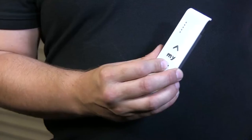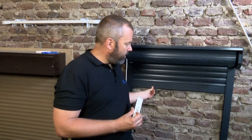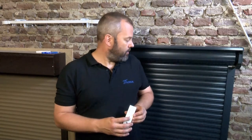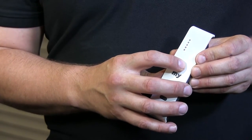I do that by pressing the button and making it roll up, and then I give it a bit of work to do by holding it a little bit, so the motor has to work harder — because in the upward direction normally it works harder. I've done that. So what I can do now is make it roll down — still in the wrong direction, but I make it go all the way down, so you can have one full length of rolling up and then it will recognize the direction. And as you can see now, when I've pressed up, it's going up. So this last part of the procedure is only necessary for small roller shutters. When you have a big one, the weight difference is big between going up and going down, so the motor will have to work harder anyway, so you don't need to hold it.